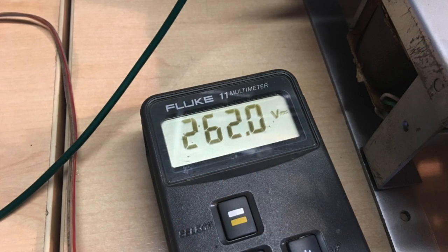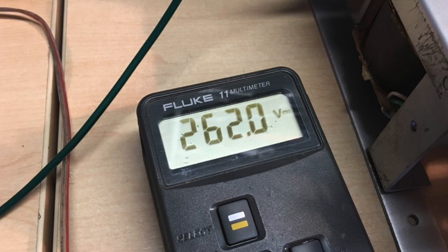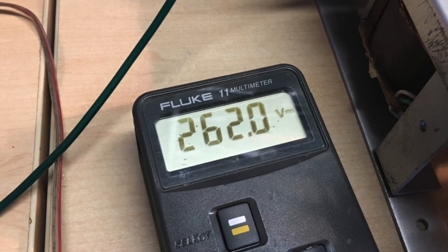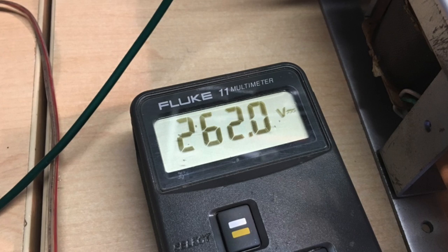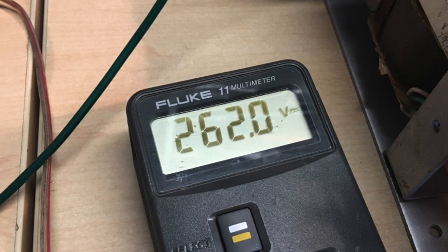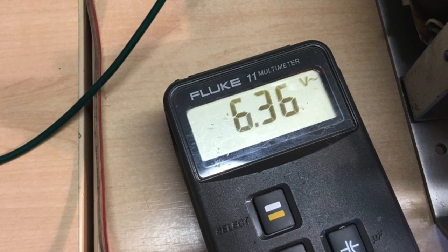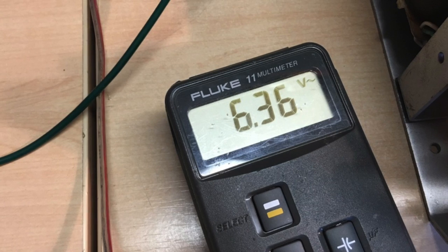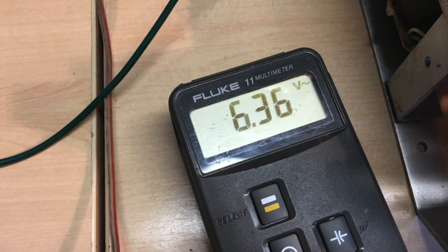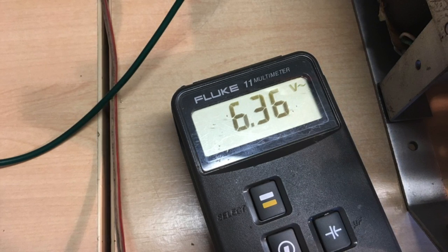Here's the result: I get 262 volts out of the new bridge rectifier. I was getting a significant amount lower than that before. I actually want 270, so this is not that far off, and I think I'll leave it here for now — I can always revert to the 220-volt input and put a resistor in series to drop any excess voltage. The heater voltage with 240 volts in now gives me closer to the 6.3 volts I want for the heaters. Before I was getting close to 7, which was almost 11 percent over the rated amount. So I'll call this a wrap and continue with the remaining parts of the restoration.